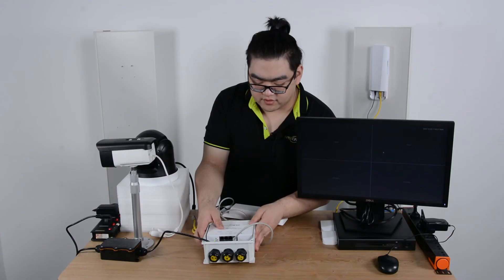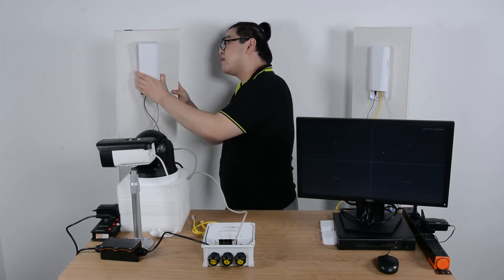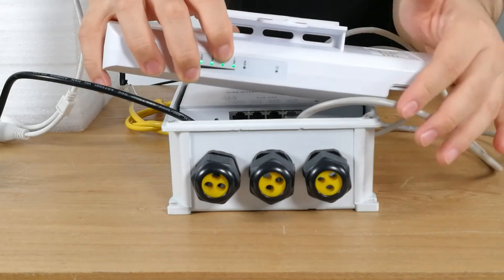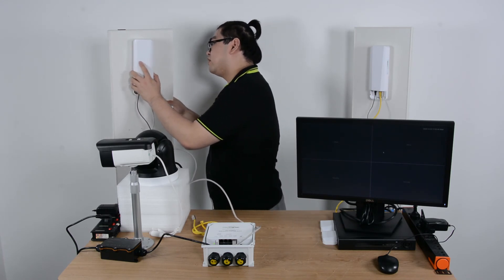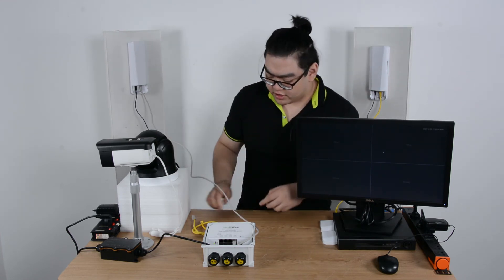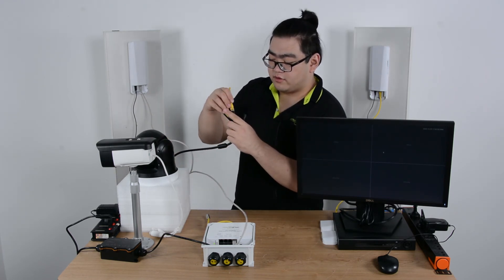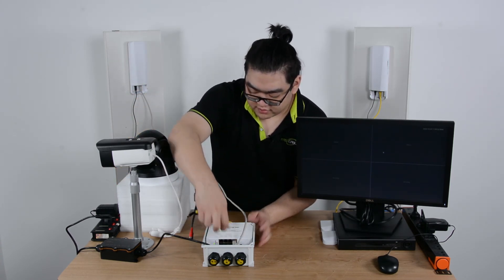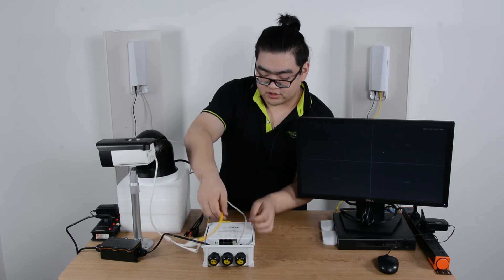Really easy to understand. I'll hang this unit up now, letting these two devices be in line of sight so they're transmitting to each other smoothly. Since this powered switch can output 30 watts, we're going to connect a pan-tilt-zoom camera and an IP camera to our powered switch — both should function properly. You can see the PTZ camera is now self-diagnosing, so we know it's on.